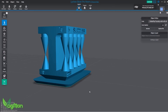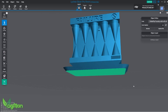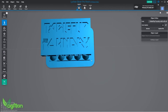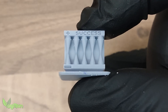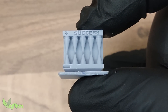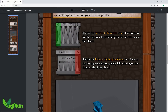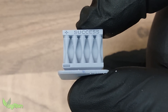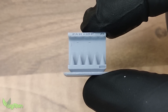So after that review, I decided to test the cones of calibration and see if that would be an easier method. It's a simple print, freely available from the creators — I'll place a link in the description for you. It takes about 40 minutes or so to typically print and once done you simply inspect it. There's a success side and a failure side to the print. If the settings you use are correct, the success side should look like this: 10 cones perfectly printed meeting in the middle. If your settings are correct, the reverse failure side should show just 5 reasonably formed cones.